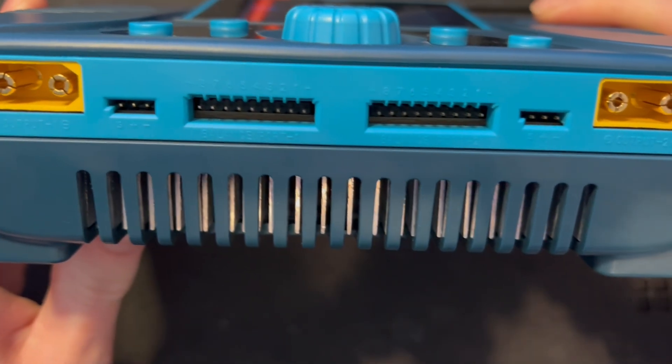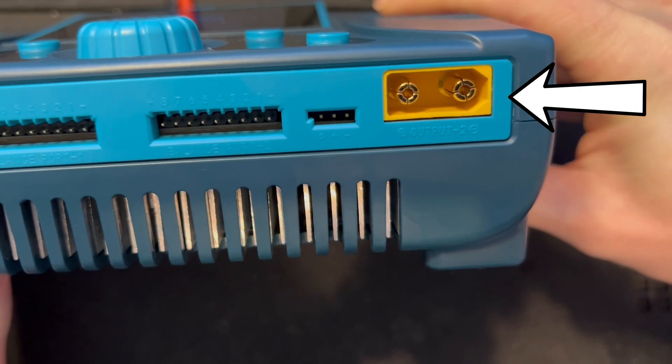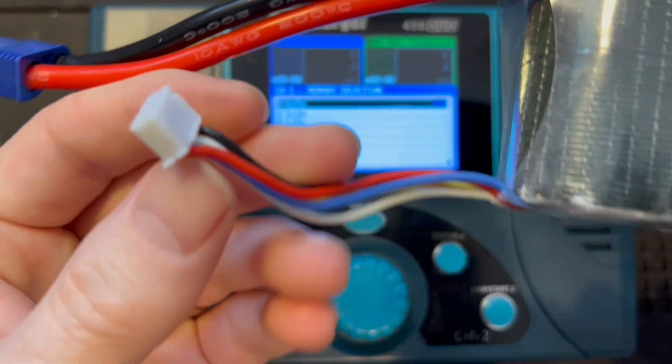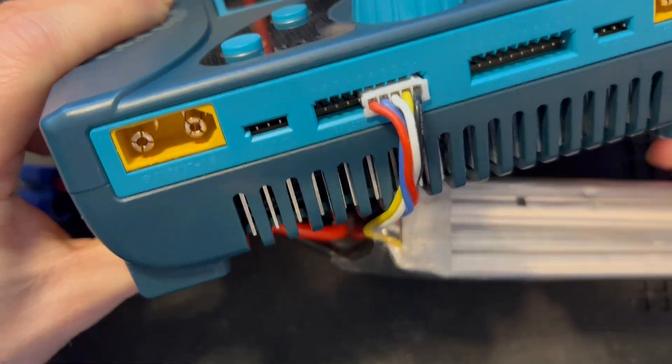To accommodate the 45 amp charge rates, they did away with the banana plugs, moving over to XT-90s. The chargers now also come with open-style JST-XH balance plugs, which means you can take the balance lead of just about any battery and plug it directly into the front of the charger without a need for a balance board.